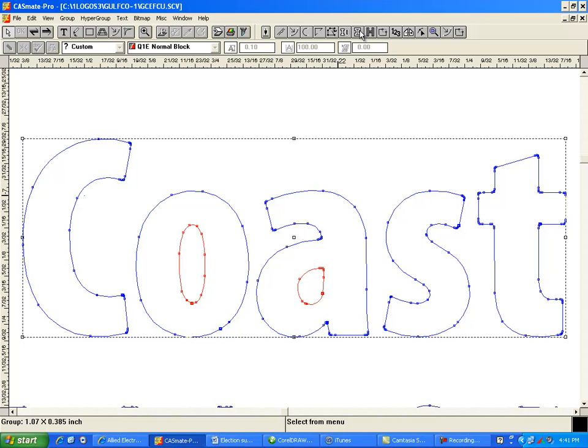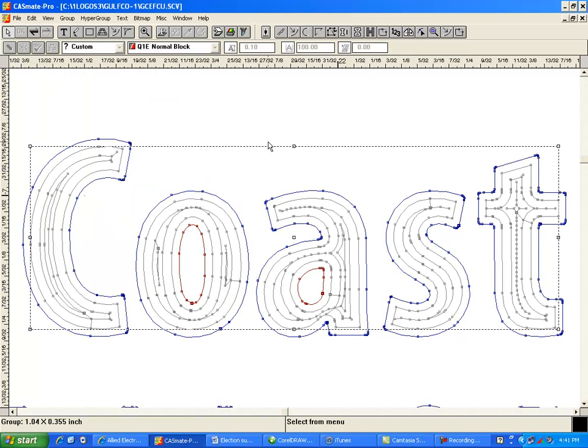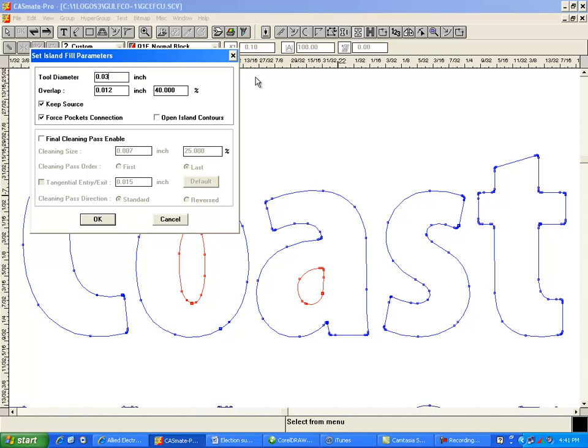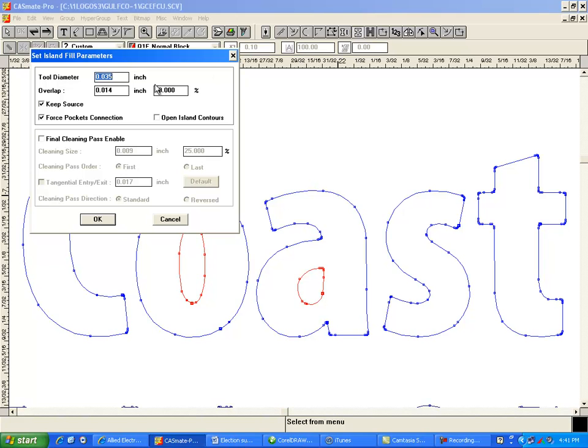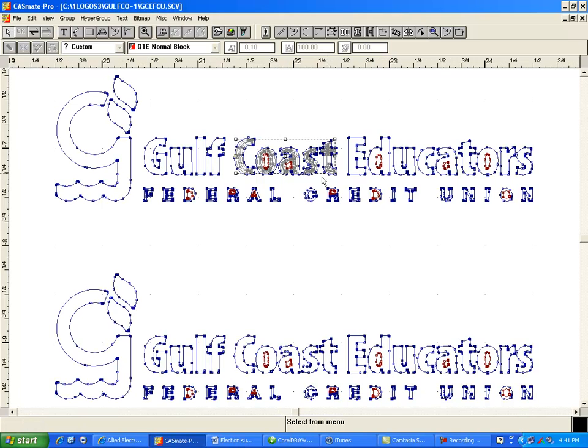If it's going to be a big door sign or a plaque maybe I'd leave it, but since this is going to be a name badge I'm going to try it at an 030 cutter. This looks a little bit better — I've got about four lines here, and some of the fatter lines will actually be two lines, so you get six lines here. I could even try going a little bigger — maybe 35 — but sometimes when you get to 35 you get some really funny-looking fill patterns especially on the O's. I'll undo that, maybe change it to 34 — 34 is a lot cleaner, so I'm going to leave it at 34.